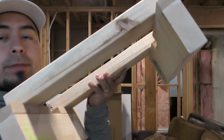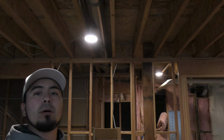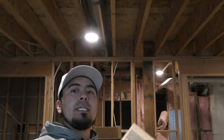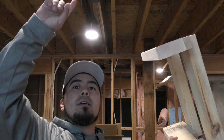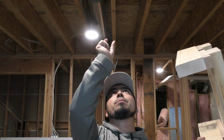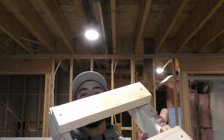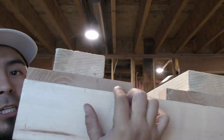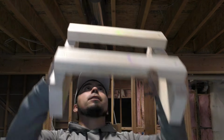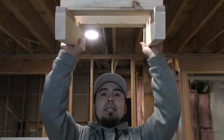as you can see, I'm gonna angle you up that way towards the joist. The joist has like half an inch of a lip there, so I got some 2x4s and supported it up with another, I think there's like a half inch here. So this is gonna sit on top of that joist there, boom, right there.